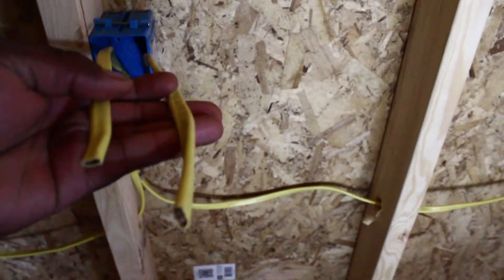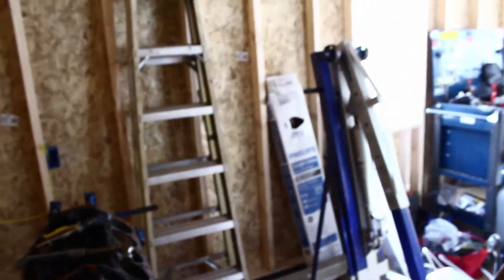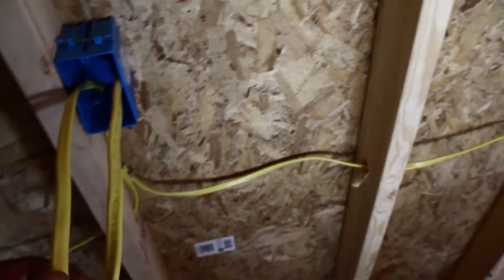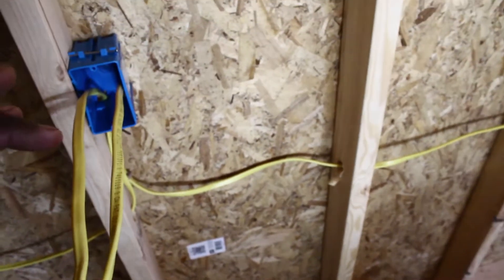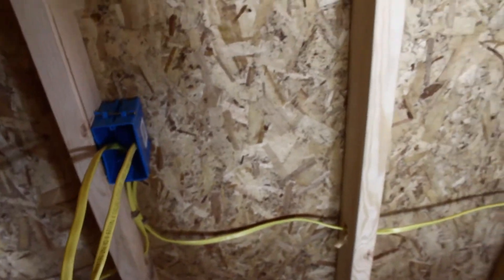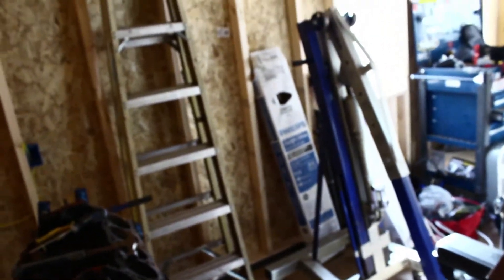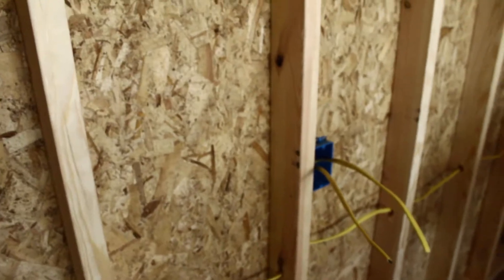What's taking so long is that I'm not just hooking these to the top screws, then daisy chaining them on down. The reason I'm not doing that is because if one outlet decides to die, all the other outlets all the way around are also going to be dead. So what I've been doing is using a pigtail on the end of the actual outlet, then tying those in with wire nuts and folding all of that back in. That way, if one individual outlet dies, power will still be fed throughout the rest of them, and it'll make it easier to diagnose later down the road. The only drawback is it just takes a long time.